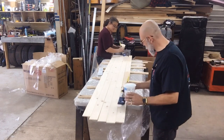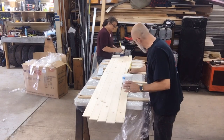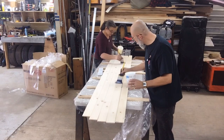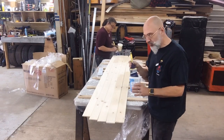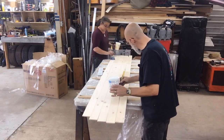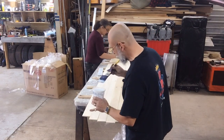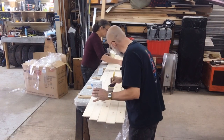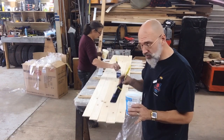Wood, even though it's cut and dried, is still a living object. Now, wood grows when you leave it like this. If you were to take a piece of wood, 1 foot by 1 foot by 1 inch thick, and put it out to dry in the sun so it gets really, really dry, and you measure it, you'll see that lengthwise, it hasn't changed at all. But widthwise, it will have shrunk.